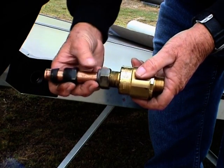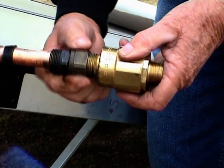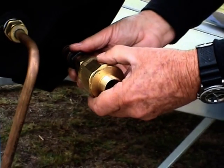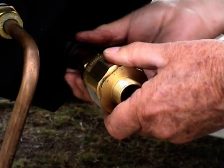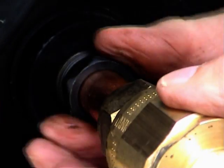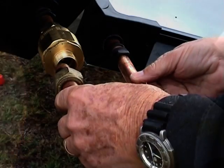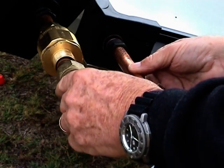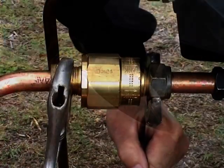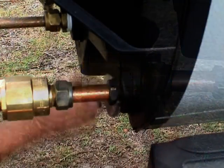Fit the HeartStat valve into the tank to HeartStat valve assembly. At this stage, only finger tighten the connections. Fit the HeartStat valve assembly to the hot inlet of the tank. Fit the hot pipe to the HeartStat valve assembly and to the collector outlet. Securely tighten all connections, do not over tighten.